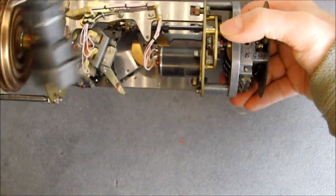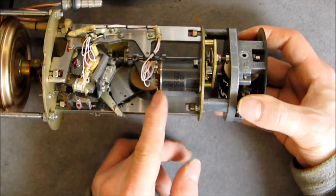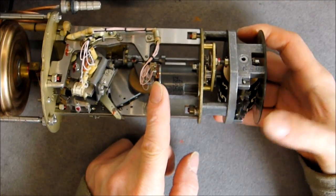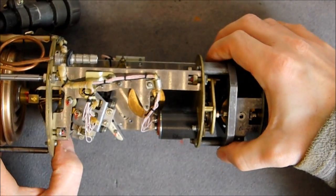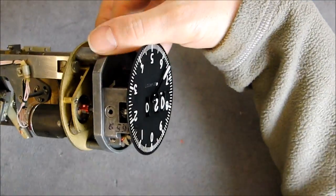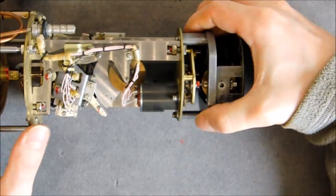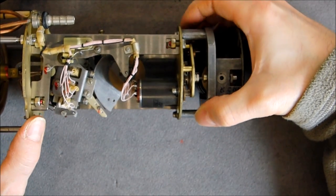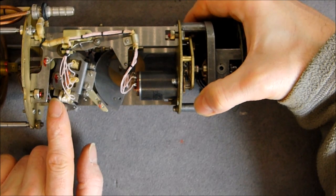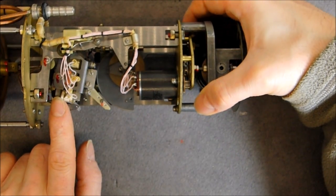And yes, we have what seems to be a synchro resolver or encoder maybe. Yes, we have 6 wires out of it. So I am checking if, yes, this makes the whole thing move. In fact, if I turn here, the whole assembly moves and it is counting. So there is a whole thing in here. So it must be a synchro transmitter. I did not see it here. We have 3 coils, solenoids, probably. So it can go quite far, this thing.